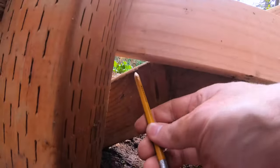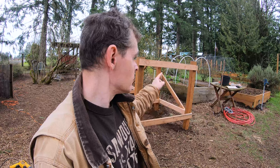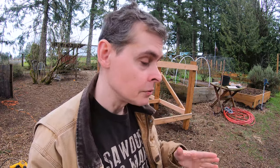The framing is finally done. I've buried the vertical posts in an attempt to keep the structure from leaning out of square. The diagonal braces are also there to help keep it true. The siding will be next. I've got some salvaged cedar. Hopefully I'll have enough. If I don't, I may go over my $100 budget.